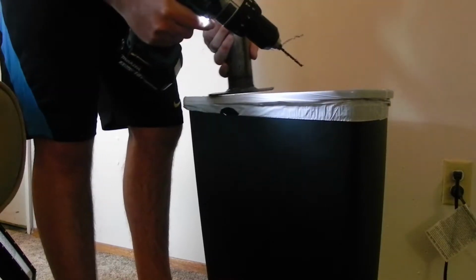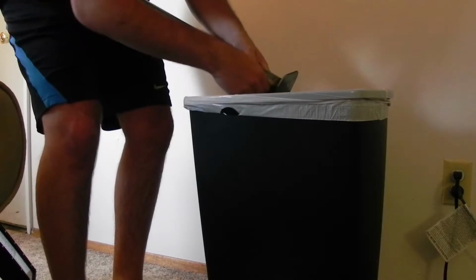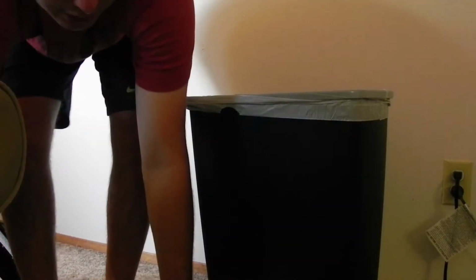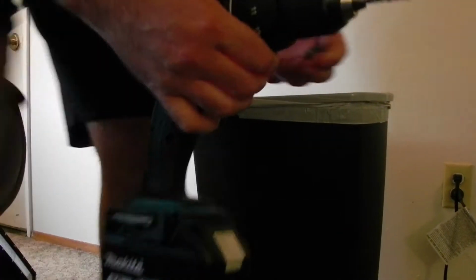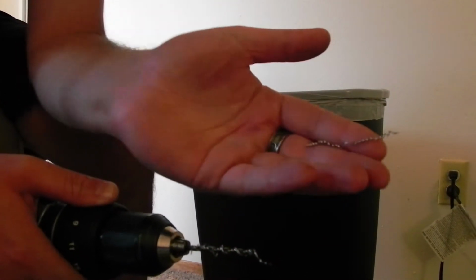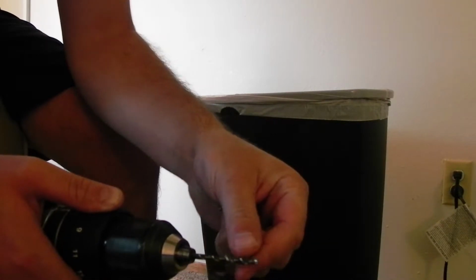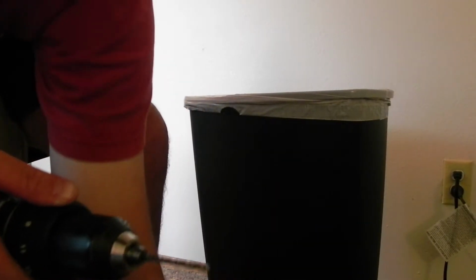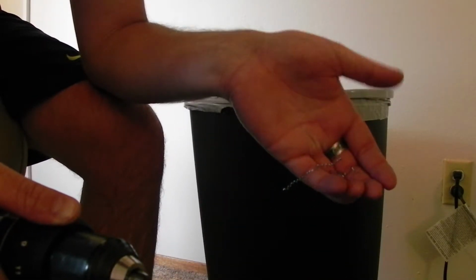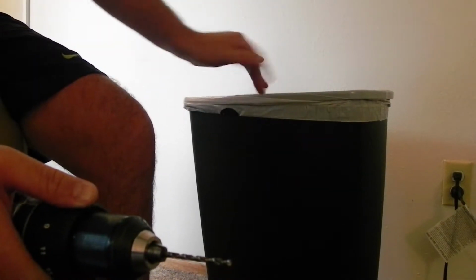And that went deeper than the other ones, and it still didn't start screeching. And the big thing here that I'm going to show is that the old bits did not chip. So chipping is a big thing. But if you look here with these ones, I actually got some nice chips out of that cut. And chips are, you want to see these long chips. That means that the bit is cutting well. It has a good feed rate and it has a good speed. So that's what you want to see when you're cutting steel, is these long stranded chips.